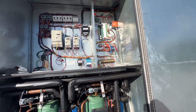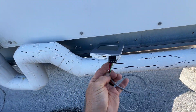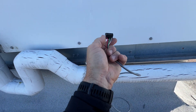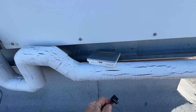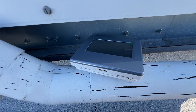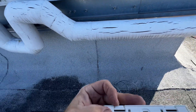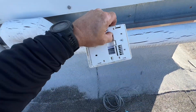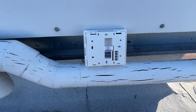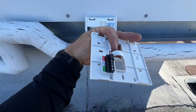That kit came with the cable and the connector to plug in — that you saw was already installed on the machine. You've got 24 volts, ground, positive and negative, signal here, and that's just going to wire into the back of this touchscreen. I'll show you how to get this open — it's fairly simple. There's two tabs on the top, you push them down and pull the sub-base off. Those were released and it just pulls off — there are our terminals.